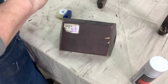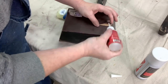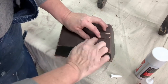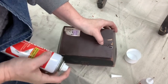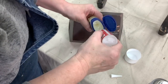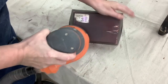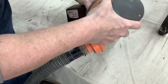When I was sanding this little box, I noticed a mark where a piece of it is starting to splinter. It's not very thick wood, so I don't want to pull that splinter off. What I'm going to do is fill it in with the Starbond glue — not only will this adhere that splintered piece, but I can also use it as a fill-in. With the accelerator, it only takes 15 seconds to dry. Remember to dip the tip of this quick-dry glue in some Vaseline so the lid doesn't stick on it. Then I can proceed to sand that smooth. Yes, you can use that Starbond glue with the accelerator spray dryer as a little bit of a filler — it just makes it nice and smooth.